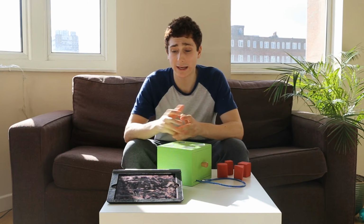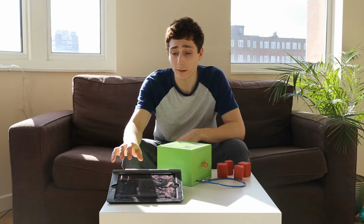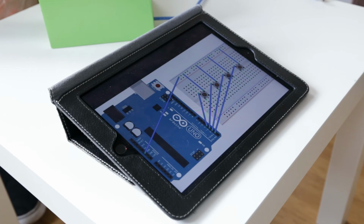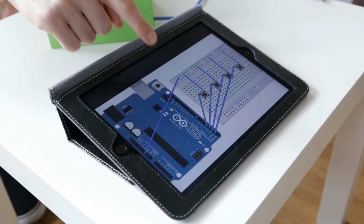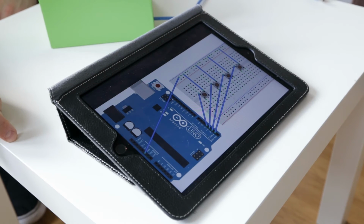For this project, the class was told to each create a sketch using Fritzing. Fritzing is a piece of software used to sketch out and model common hobbyist boards such as Raspberry Pis and Arduinos. So as you can see here is the diagram for my working circuitry. You have the Arduino on one side, which is connected to the breadboard via the ground rail. I've connected the ground rail to the top line, which means I can access it multiple times for each switch. Each switch connects on one side to the ground and on the other to the board using ports 2 to 5 so that I can interface with them and measure the readings.